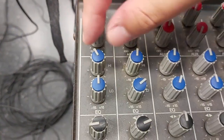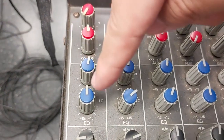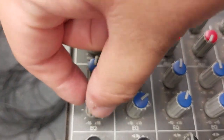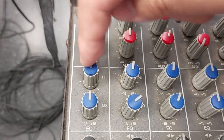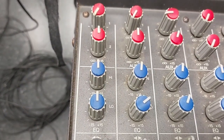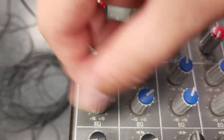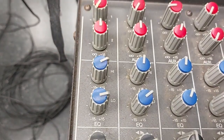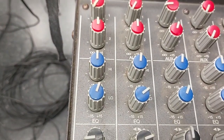What you see here — you see this low and high. That implies it's an EQ. This is a two-band EQ. This one controls low frequencies, and this one controls high frequencies. Their default position should be set to zero. Zero means there's no boost, no gain, no reduction — it's just flat. When you boost it, this would add bass to the signal, and this would add high-end treble to it. This is a pretty simple mixer, so there's no mid-range control.